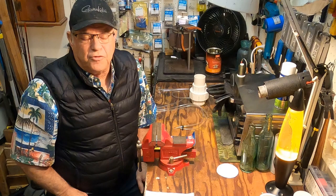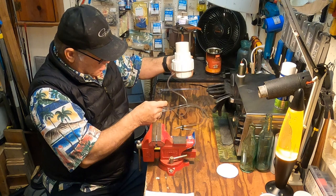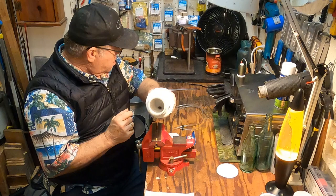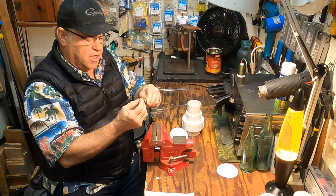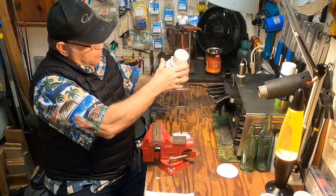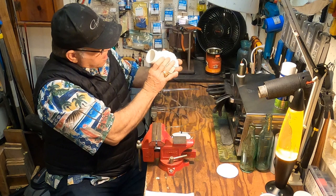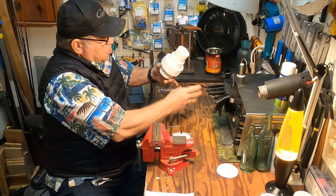Let's start putting together the fluid beds. I already put one together ahead of time — let me show you what I did. You can see this is just about finished, it's got everything but the filter in it. On the inside I put a rubber grommet over the end of the tube — this is one of these black rubber grommets. Not something you have to do by any means, but I think it'll hold up a little better because I plan to keep this in a milk crate and move it around. I wanted something solid without restricting the airflow. The rubber grommets give it a nice clean look on the outside. Let me show you how the filter goes in.